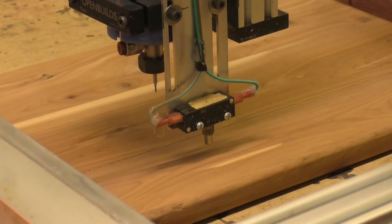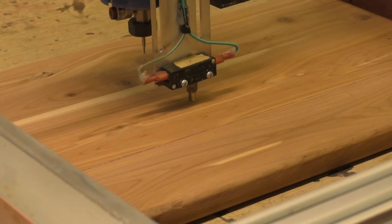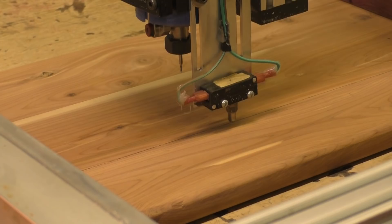I'm gonna hit reset and bring my speed back up. All it's doing is finding how curved or warped this board is so it'll cut the pattern exactly to this board. So if the board is leaning to one side, cupped a little bit, or bowed one way or the other, this will calculate all that out.